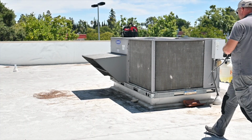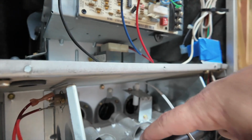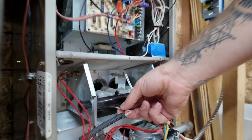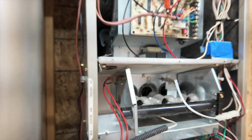Also, for the maintenance for the furnace, we're talking about the furnace right now. The burner assembly needs to be cleaned over the time of summer. While you don't use the furnace, it usually gets stuck with dust and dirt. Also, the flame sensor, which is a crucial part of the protection and security of the system, needs to be cleaned in a timely manner.